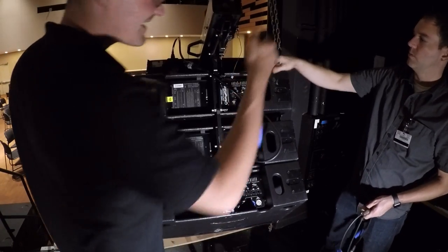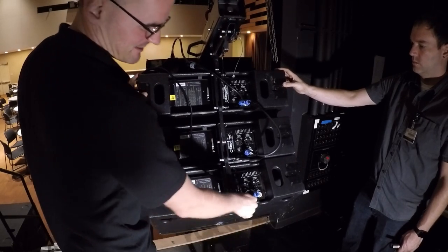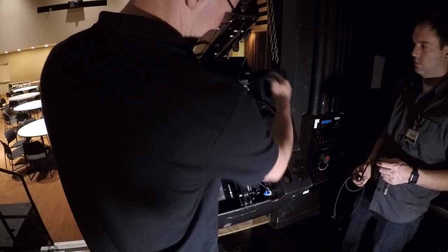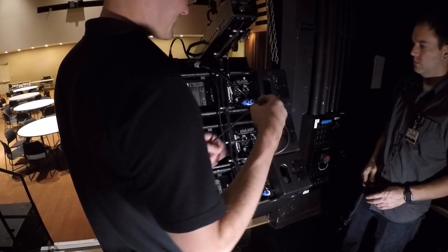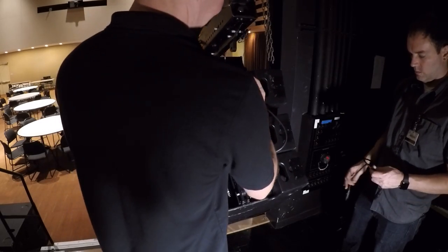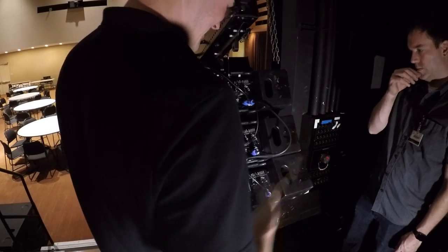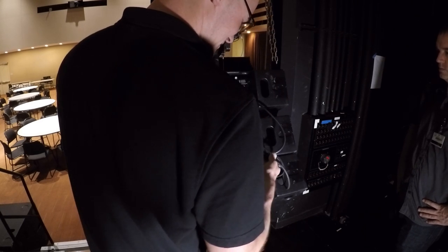Then the last guy. If you had three more boxes — if we're doing six per side — you'd link that to the next one, and then the other two would take the next circuit. So we're going to have our main signal; I usually like to go in the top one, so it'll come in — that's where it's going to come out of your board. And then after that, we'll just link these all together, unless you want to do individual control, but normally we'll just link them all together. So audio signal in, pops out, goes into the next one, and then same thing for the second — same as the first.